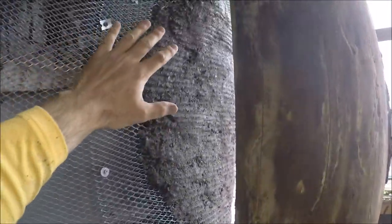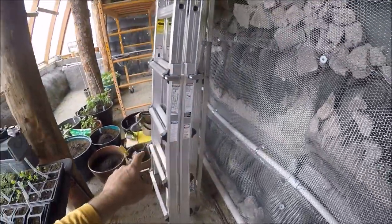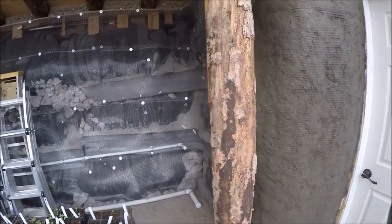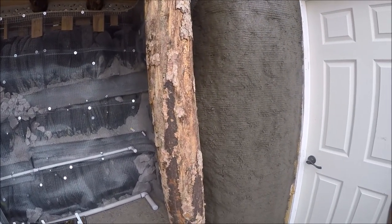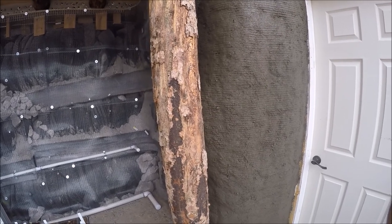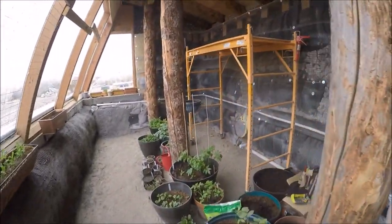You can see I've scratched this already. I need to go make another mix - I'll go ahead and do this wall right here and finish it all the way to the top, then work on this next section. That's probably all I'll get today with three or four hours left, then we'll continue going down the wall. This is a scratch coat and I have another coat to put on, so it does a lot of work. It goes faster than I thought it would, but it still takes time. It's not hard work at all though - I was kind of surprised how easy it was.